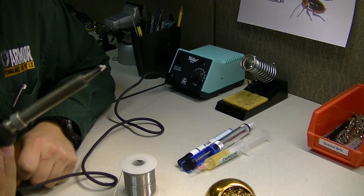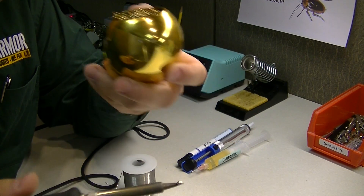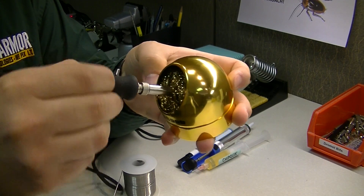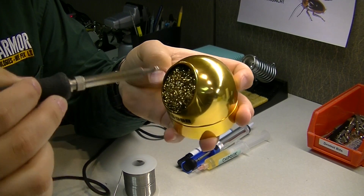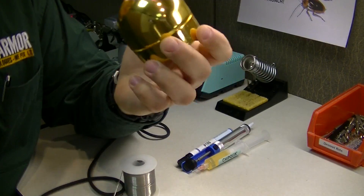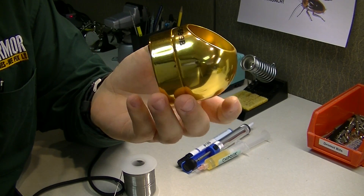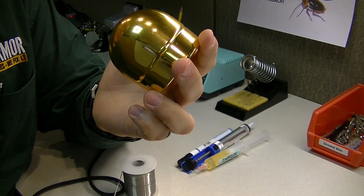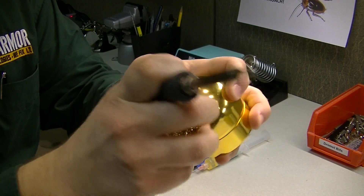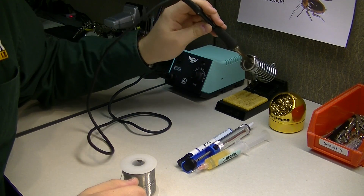The more you do that the better off you're going to be. It's not necessarily going to make your tip shiny, it's just going to keep it clean for a longer period of time. The steel wool can be used in conjunction with a wet sponge if you find there is buildup that's really hard to get off — just stick the iron in there and give it a good twist. Over time, over weeks or months of use, the dried solder will collect at the bottom of this receptacle, which you can easily dump away. We just want to make sure we empty this out — if it falls over on the desk we don't want that stuff getting all over the work area. So along with your steel wool and your wet sponge, always use these whenever necessary to ensure that you have a clean tip.